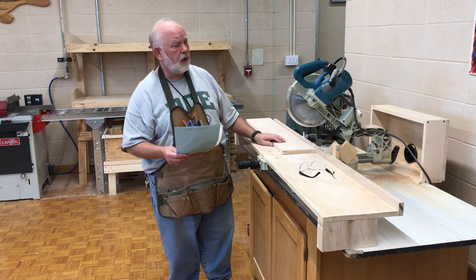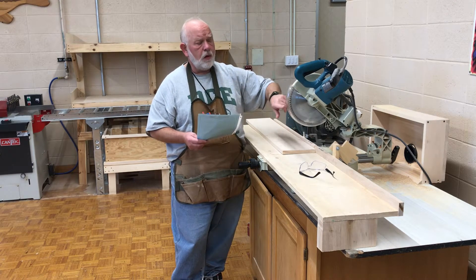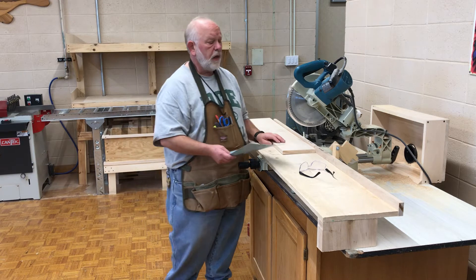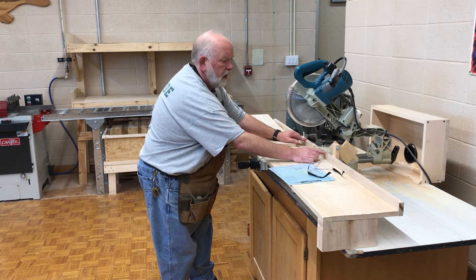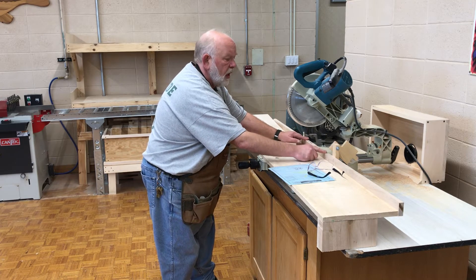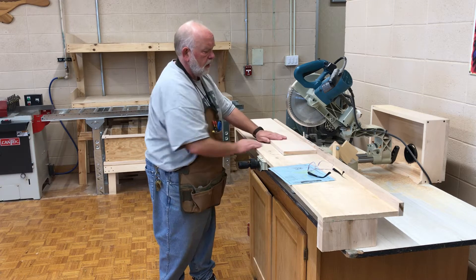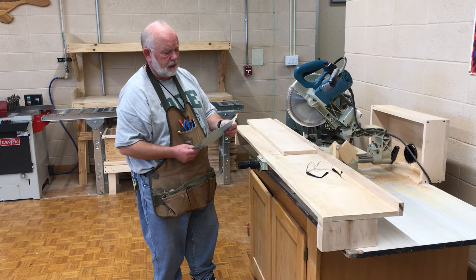Make sure you check that the guard is in place. Right now I had it up, but we want our guard down. This machine will automatically lift the guard as we begin to cut. We need to keep our fingers six inches away. On our fence right here we have 'no hands' markings and black lines as a reminder. Keep your fingers back away from that edge — six inches.